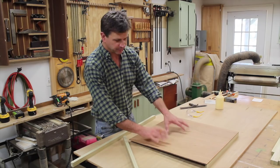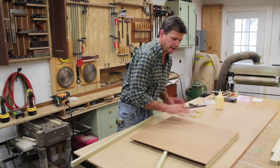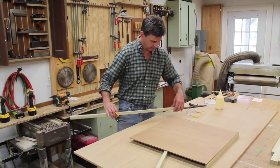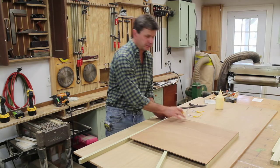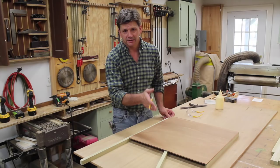When I'm building a braced panel like this, I use the molding that I'm building the panel with as a prop or a shim to hold the quarter inch plywood nice and level. Then as I work my way around the panel attaching the molding, I hold the first piece of molding upside down on the panel, make a mark, and that's my first cut. Then as I work my way around, I'll hold the long point of the miter at the long point of the piece of molding I just attached, come over to the opposite side, mark a line, and I always draw a little indication line that tells me which way I want to cut when I get to the miter saw.